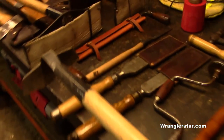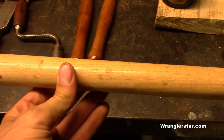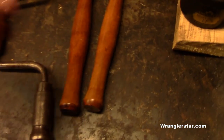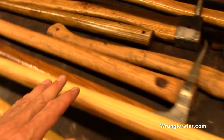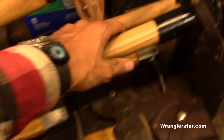We want to strip this off, and sometimes it can be really tough. Most people use sandpaper, but I'll show you a way to get these things stripped off very quick and efficiently, and then how to treat the wood before we put them away. You can see the difference here: a varnished handle turns into this cadaverous gray from UV light, and then you can see what you get from years of boiled linseed oil — that deep rich wood color on some of these tools. These Rogue Pulaskis here I've recently stripped the varnish off.